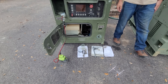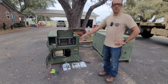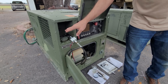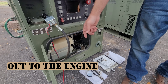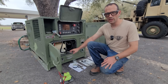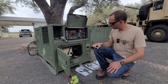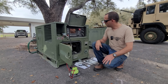Changing out that pump was unsuccessful, which makes me think the pump was not the problem. I'm thinking there might be an obstruction in the fuel pickup line — I tried to stick my arm in there but couldn't get it deep enough. These newer generators have a hookup similar to the older ones where you can siphon fuel. I set up a temporary rig using a Ryobi battery and a fitting from my auxiliary fuel line adapter kit, confirmed it's drawing fuel up from the tank, hooked it up, and I'm going to let it run to prime the system.